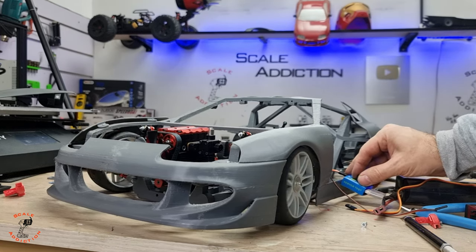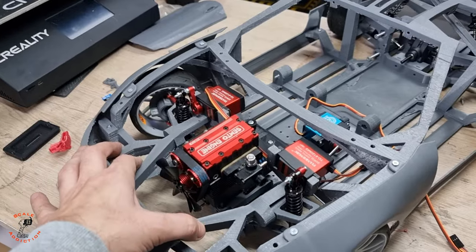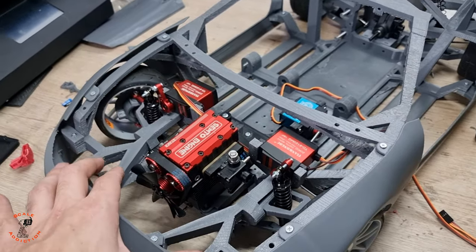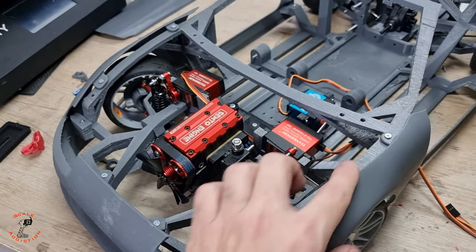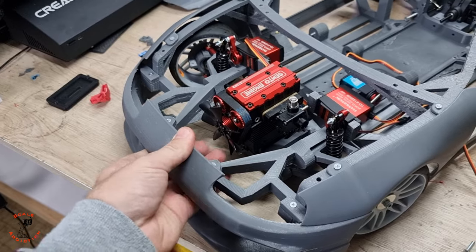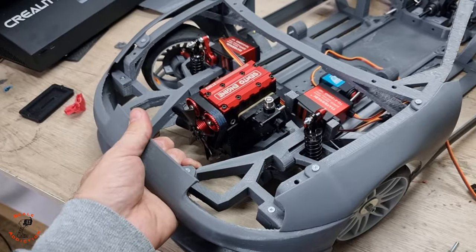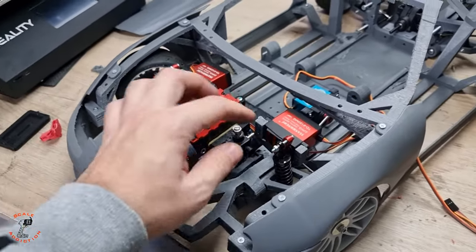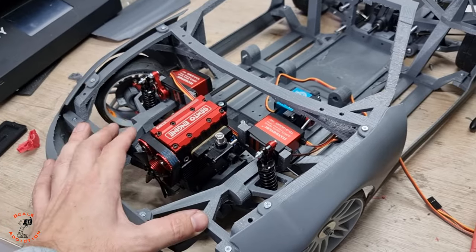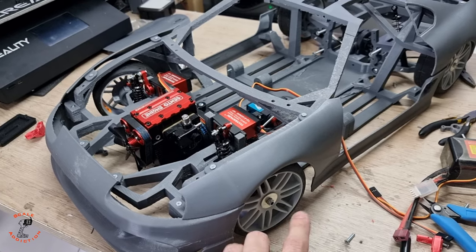With the nails done now. Alright, finally. The front part of the chassis is very good. I don't have anything wrong with it. Everything I designed held up pretty good and the holes are aligned with the fender and the bumper. And the bumper is really solid. Right now this piece with the chassis is one part, it's solid now. You can even hold the car with it. And the servo is working very good. I'm sure they can handle the engine weight and the body weight. So for now it looks very good and the steering angle is very good.